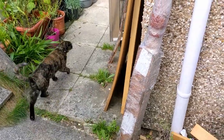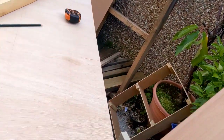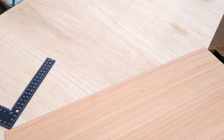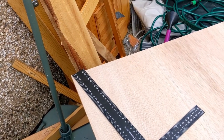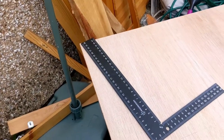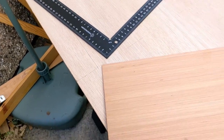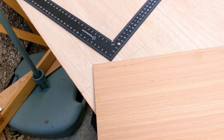Now there's a problem with that because if I line up where I've got these two holes that mark the sort of 38mm — that's the keel line. The problem with that is that the boards I've got will not quite reach. Now this two inches is defined by essentially allowing a handrail around the edges of the boat and then allowing a vertical drop from there. This is probably going to be near the height of the seat, and that can be raised higher — that's not a problem.